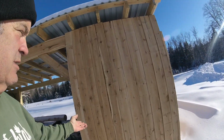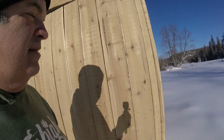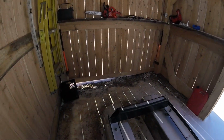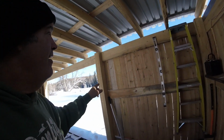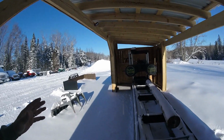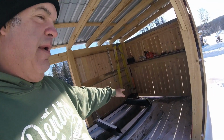These are basically just 1x6s, 1x7s, 1x8s of cedar, just cut random. Some of them are deeper than others. The ground that we're on here is gravel, but you can't really see it. Well, I guess you can see it right here, a bit of gravel. So these are true 6x6s. The front ones are 8.5 feet by 6x6. The back ones are 7.5 feet by 6x6. They're basically just sitting on the ground. In this area where I live, there are a lot of log homes where the first row of logs was put down 160 years ago, and they're still in good shape. So I'm not too worried about the cedar going bad because I have gravel. You can see there's a little bit of unevenness in the ground, but I wasn't too worried about that.